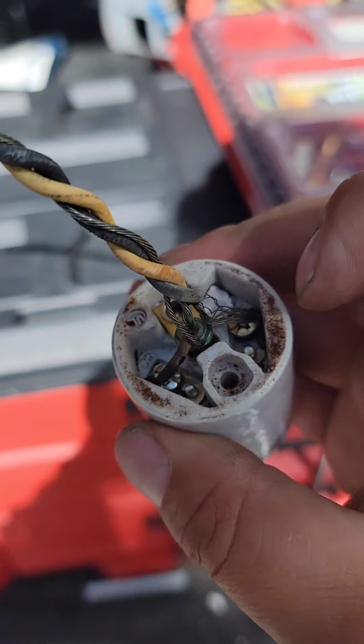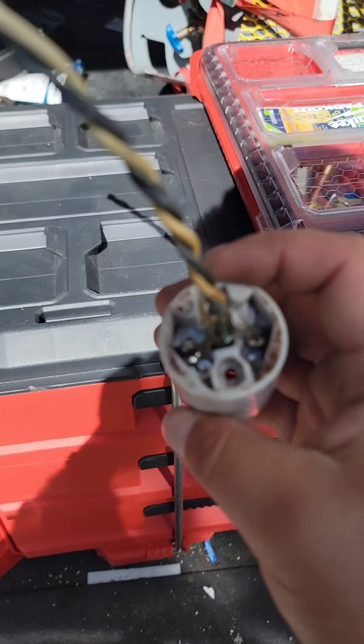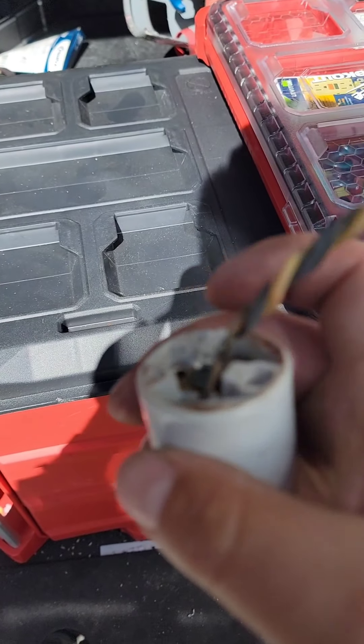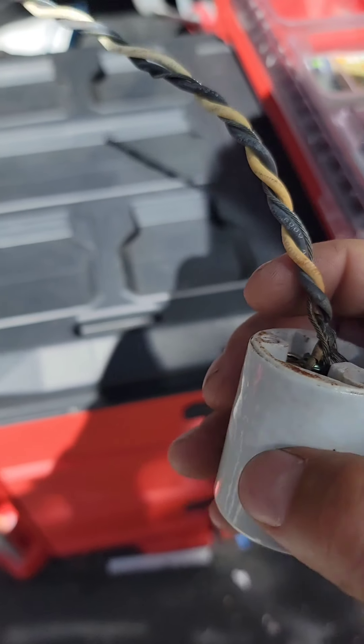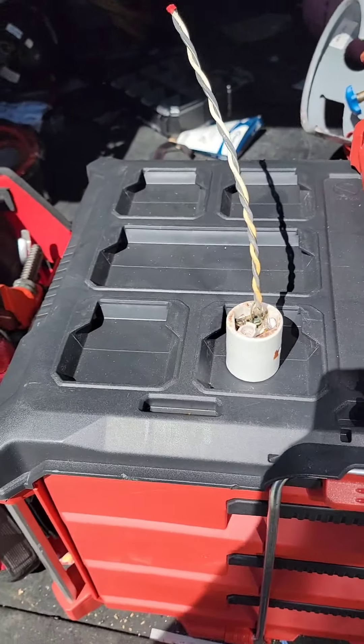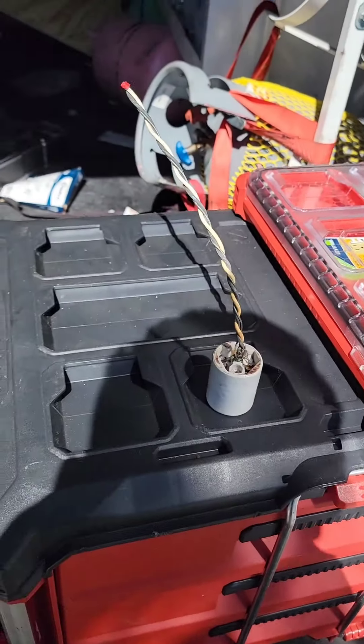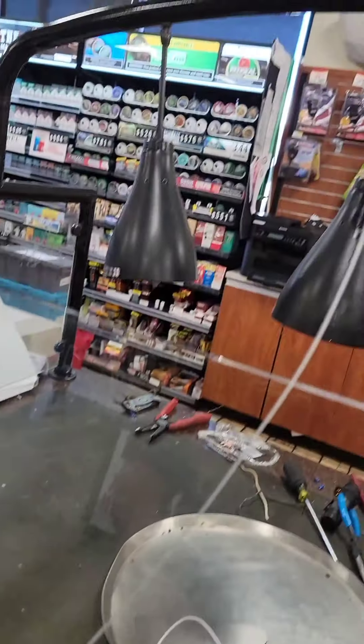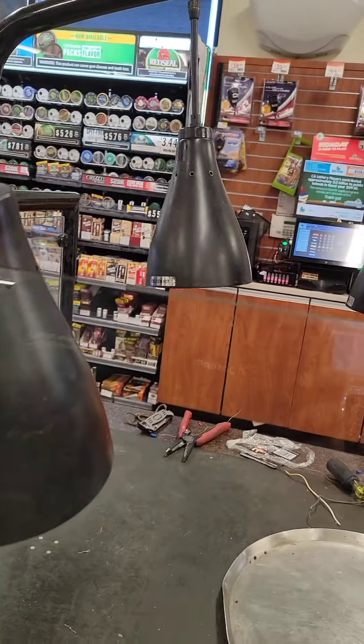This non-insulated raw wire is called a support wire. I'm piecing together that when the electrician came in, he replaced it with a completely different ballast that's not this style, and I'm pretty sure that's why it kept tripping — he just decided to completely shut that light down. There's literally only enough space for those three wires to go in that skinny black feed that feeds the light. This right here is me running the conduit through — it was a huge mess. You just have to make sure you keep the tape on the right wires.